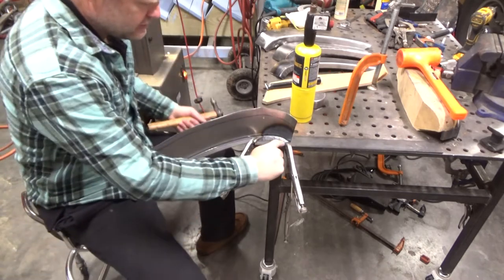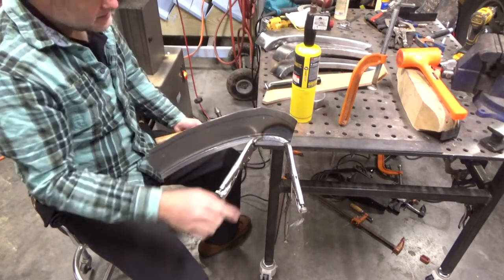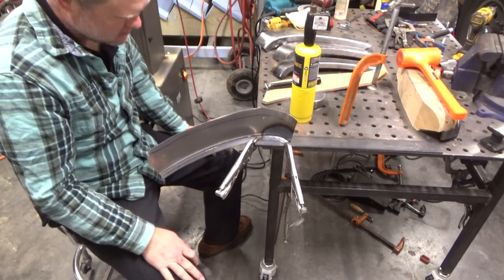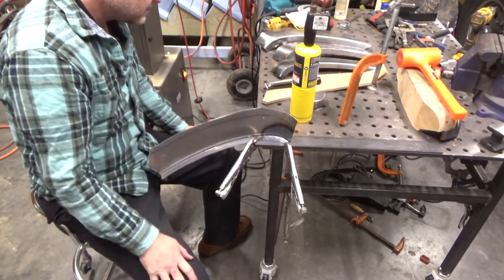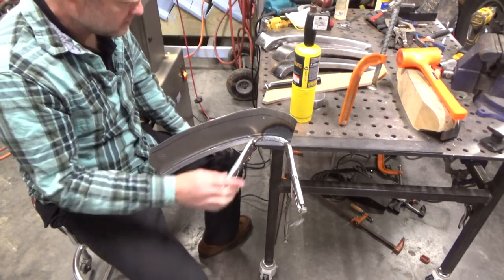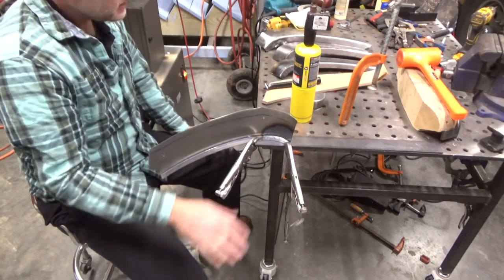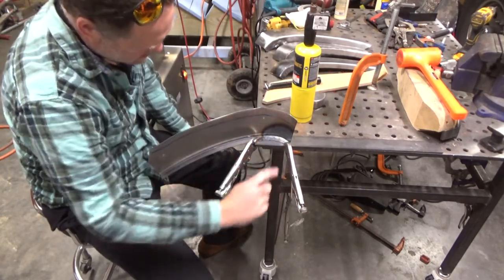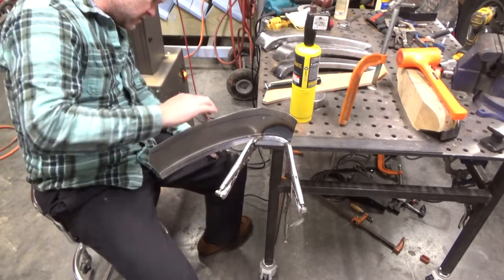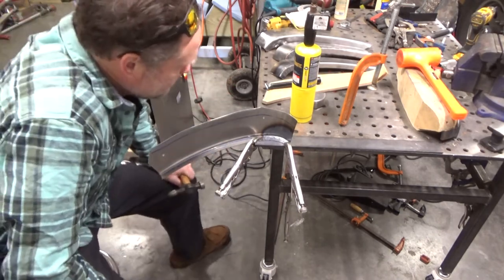Now, this is flat, like this bar is, so I'll have to take that out. I'm going to let it cool, that way it can't stretch out or bend anywhere, so I want it to stay in the curvature that it is. Let it cool down, get it back on the hammer form, make sure this curve is back where it needs to be. And then I also saw there was one little spot over here I could show you in the next video where maybe the radius was a little too soft. And so that looks pretty good.